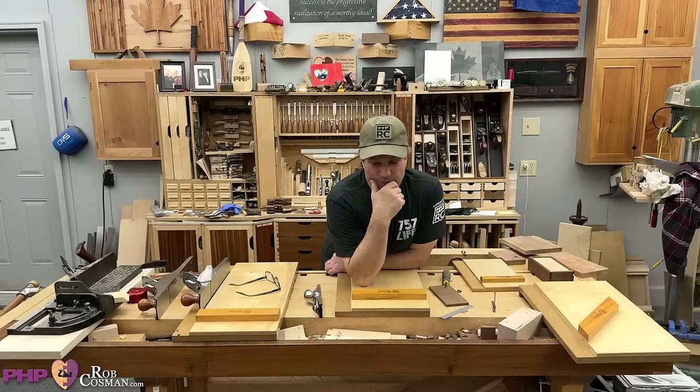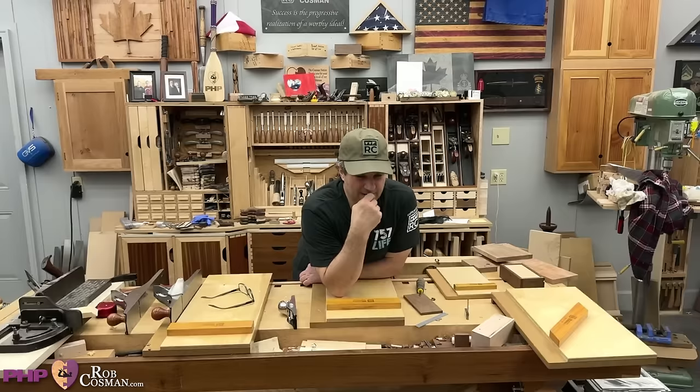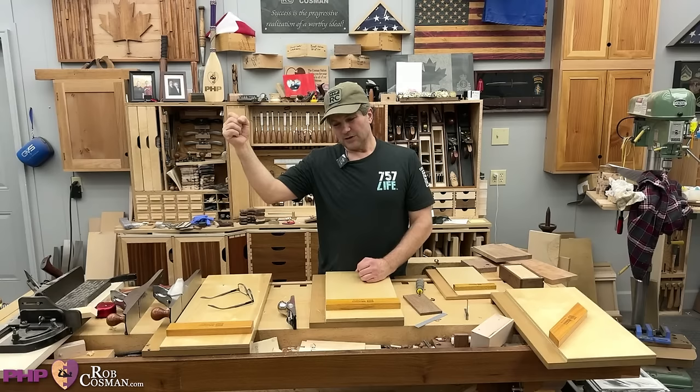The best example: I have a good friend, Mike Schmeck, up in Ontario, and Mike had, I won't say the brand name, a combination machine, expensive. I think his machine was $20,000 when he bought it. And it was a jointer and a planer and a table saw and a tenoner and may have even been a few more things. And the jointer, in order to make it a jointer, the table came down. In order to make it a planer, you lifted the table up like that and you ran your boards through. Same cutter head worked on both. But no matter what you did, the minute you would lift up that table on the jointer and set it back down, it would never line up perfectly and you'd have to go through and fuss with it.